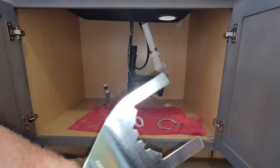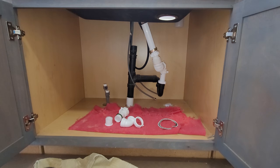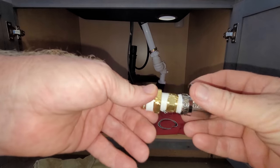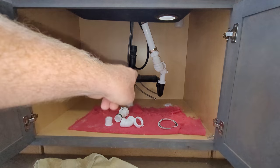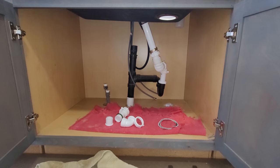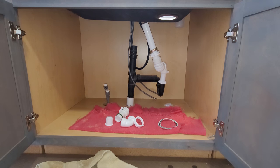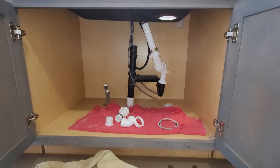They had a terrible tool - not a nice round one, a ridiculous square thing - so I'm probably gonna use it and take it back since it was 15 bucks. I showed the hardware store a picture of my pipes coming out of the ground - got a three-quarter inch plug going into the water lines. They said I'd need a coupling, then a reducing coupling. I can't crank these tight enough to not leak. I blame them a little because somebody in the know should have just said to use SharkBite - you can just cut that pipe.